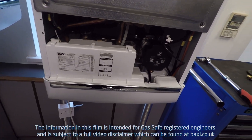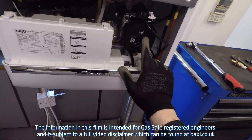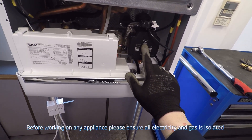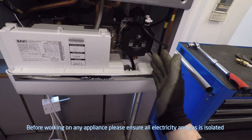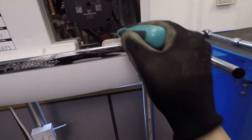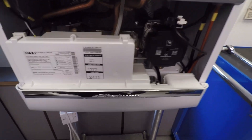This time, as you'll be able to see, it's the same boiler — a Platinum or Durotech — and we have the ERP pump on this one. Because the body is slightly different on the ERP pump, we basically need to remove this panel, which is only two screws: that one there and that one just above the PRV. Then we can get onto the hydraulic inlet assembly and take it out.